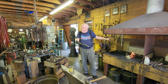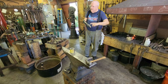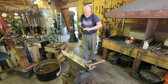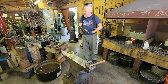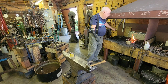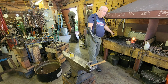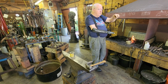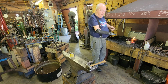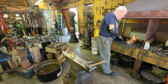Now, what I see, using borax. Yep, that'll work too. I like the regular forge welding fluxes a little better than borax. Borax kind of has that, and for a chain link, it's fine, or any other weld where the pieces are held captive. But the borax, in my experience, is slick. So when you go to do a lap weld, everything wants to slide apart. Some people throw iron filings in it? Yeah, that's what Easy Weld has in it, iron filings. It helps it not slide. Right. But you have all those little pieces of iron filings on the outside of your weld when you get done. And if you want it to be pretty, you have to go back and finish all that up. The Crescent welding compound's the exact same stuff, but without the metal filings. So it's easier to finish.